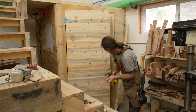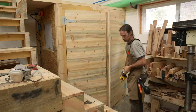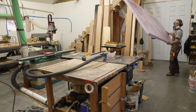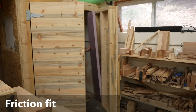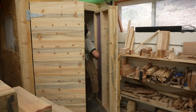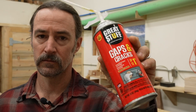My doors were a little gappy in the front, so I put a strip on the front to hopefully have less dust escape. One of my secondary goals was to reduce the sound level when the dust collector is running, so I decided to use some foam insulation. This is two inch foam insulation from Home Depot — it costs about $50 a sheet. I used two sheets for about $100, and that was the only thing I actually bought for this project. I used caulking on fine gaps, and for anything thicker I used spray foam insulation.